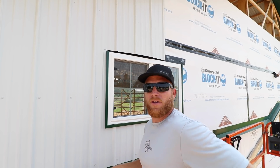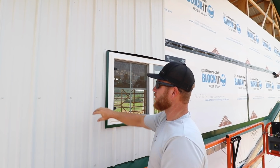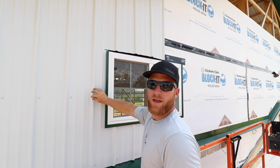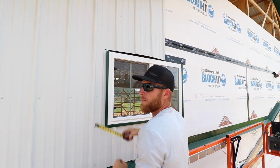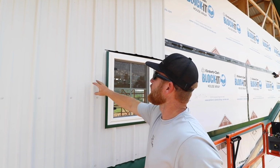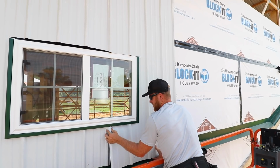So when you're making your measurements, we always say from center of good rib, which the good rib is the one that laps over the siphon rib from the previous panel. So we'll always measure from the center over, which is where I came up with my 5 3/8 measurement. It was actually 5 5/8, sorry. But hopefully that makes sense. It gives us a nice reference point.